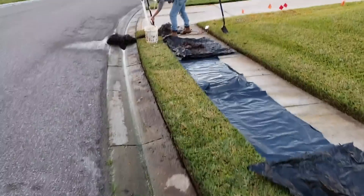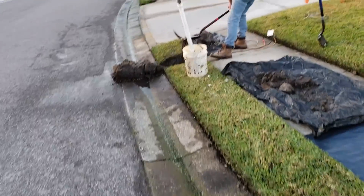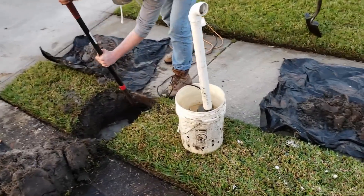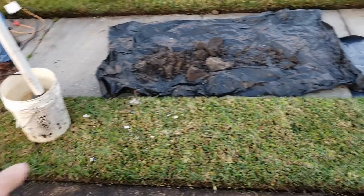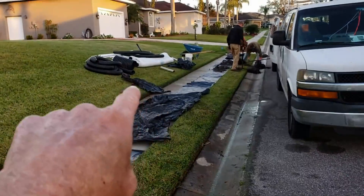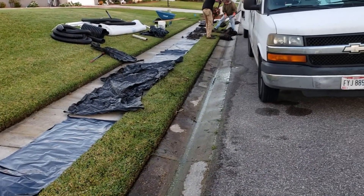So we're going to dig a trench down there where Matt's at, and we're going to put a sump pump in there temporarily. See the bucket? I drilled some holes in it. Basically what we'll do is keep pumping this water out as we work. Then we're going to run French drain — we're going to use both the styrofoam peanut pipe, easy flow, and gravel perforated pipe here. Let's go ahead and keep digging.